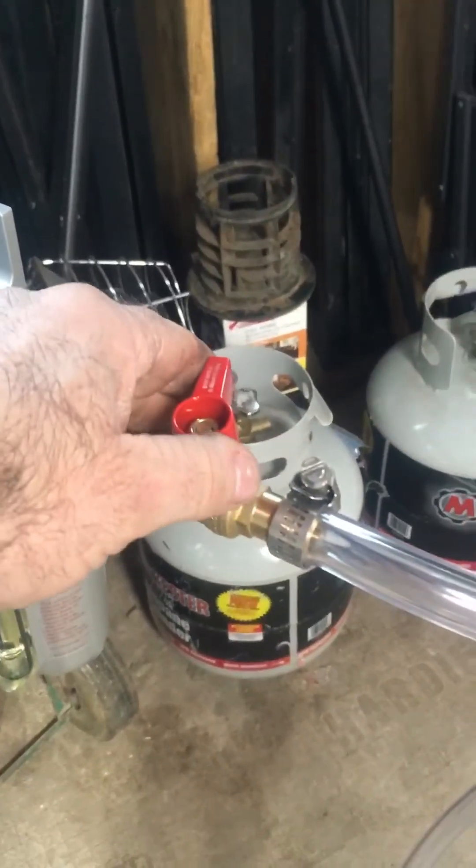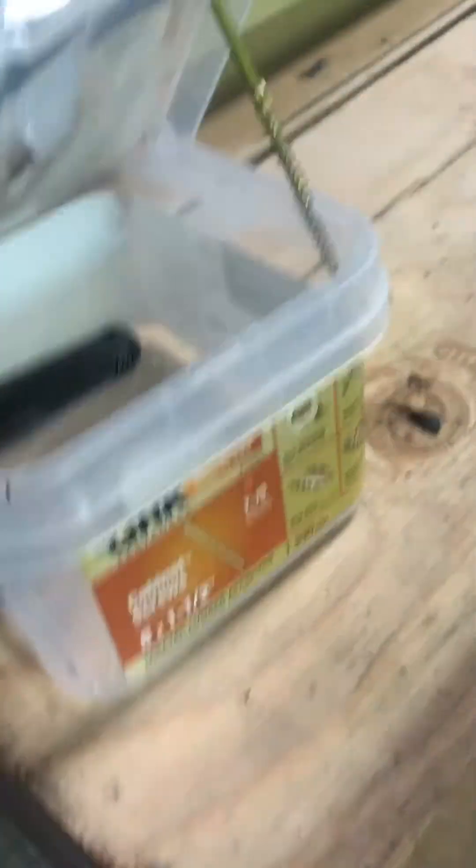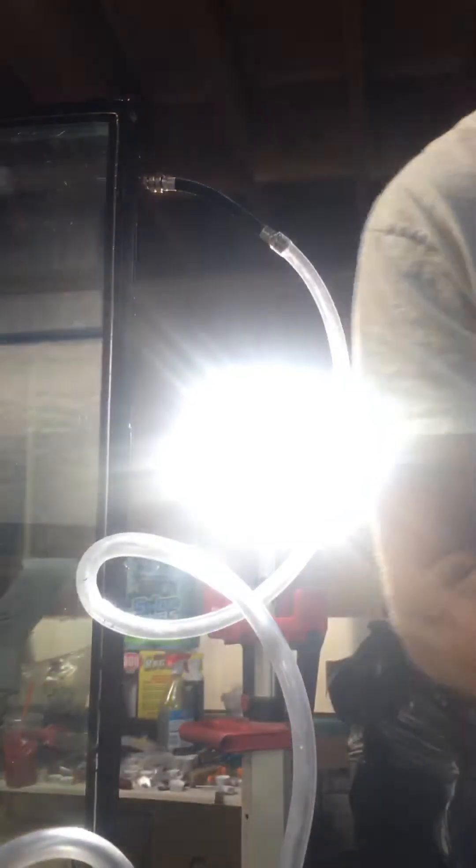Even the butane shuts off. We're full. We shut it down. You can still hear a little bit of gas inside the panes — it's slightly pressurized because it's filling up a big area. We let it go until the lighter won't even light, which means that pane is full of argon between the panes. There's a little extra pressure letting out from the argon filling and it's almost completely equalized now.